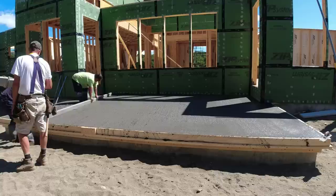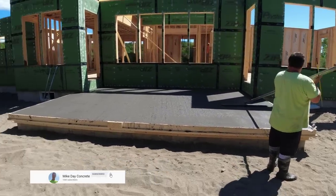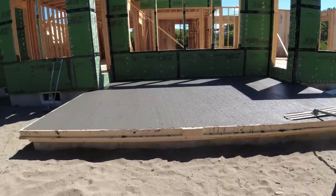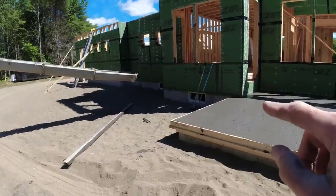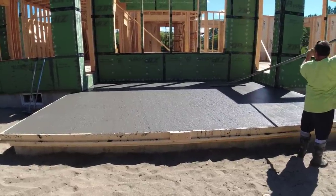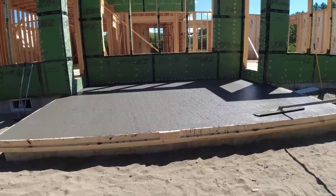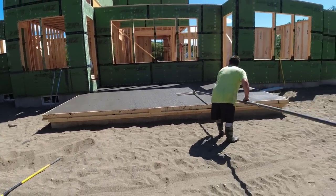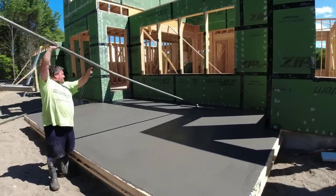That's quite a bit darker than what we normally pour, and adding those three bags of U28 charcoal is obviously what it's for. When that cures up it'll stay pretty dark compared to those really light gray concrete walls. But you really need to put a sealer on it to get the right effect — when this dries up it's going to look fairly light compared to what it looks like right now, and to get it to turn back dark like this you've got to put a sealer on it. We're going to finish this by hand, smooth finish — no broom finish — so we're going to let it set up a little bit, mag it out, trowel it out a couple times, and then we'll be done.